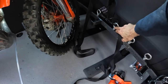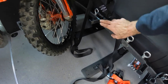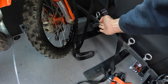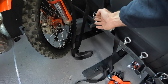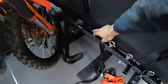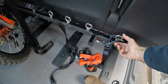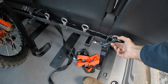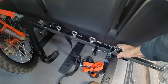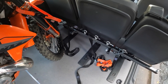If I've got three bikes, all three have the front wheel pointing off to the left and they fit in nicely. As mentioned, I want to raise this tie-down point two inches to make the strap higher so the front wheel pointing left can go in easily. I'll make some two-inch-long spacers, get some longer bolts, raise up the height of those, and that should make loading three bikes easier.